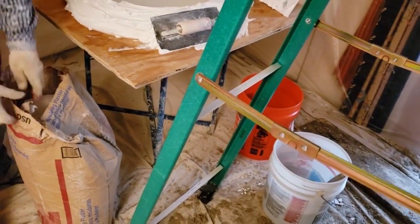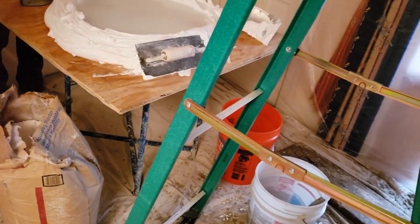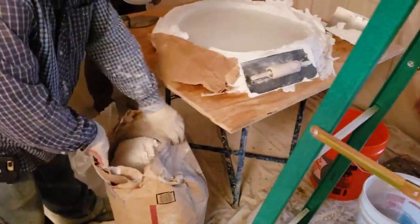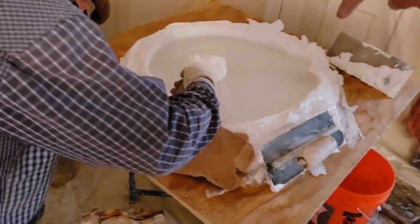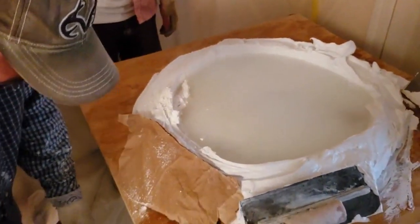Making it really super heavy. The next step is to sift our molding plaster into the lime ring. We put paper on the lime, which keeps knots from forming and keeps molding plaster from spilling onto the lime. This is not important for just a patch.